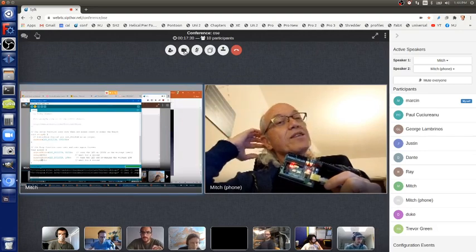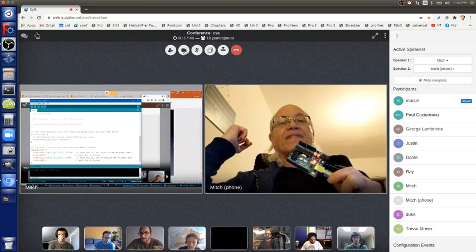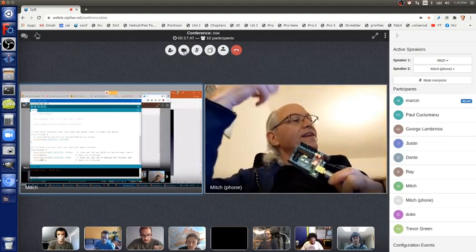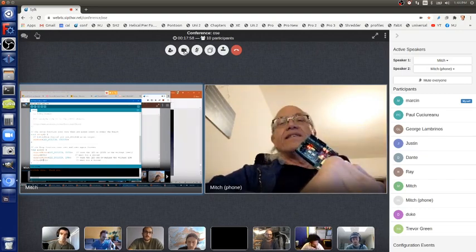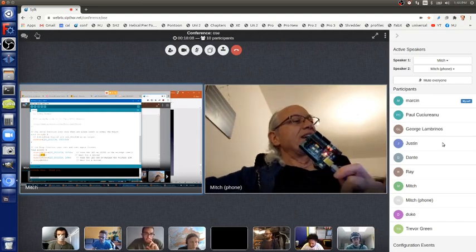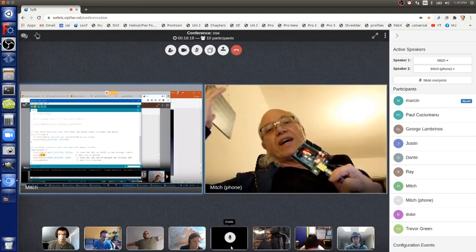There it goes. Now it's uploading and finished compiling. And now it's done uploading. And now look at the red LED. 10 times a second instead of 1 time a second. And we don't have to make them blink on and off at the same rate. Let's change the off time to be 1 second. So I'll add a zero back in there. So now here is 1,000 instead of 100, but up here is 100. Okay, but that's just text on a screen. In order to make it happen, I've got to click the upload button. So I'll do that, and then once it finishes, the red LED will go blip, blip, once per second.